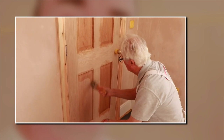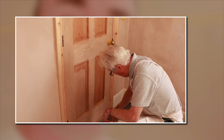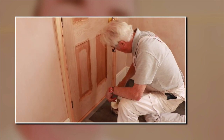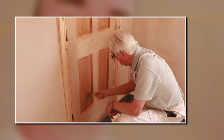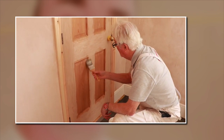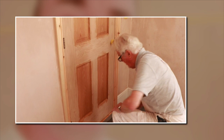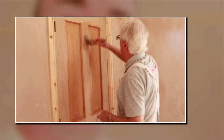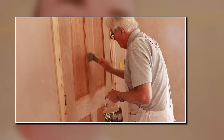This is just the first coat we're putting on. It dries quite quickly. If it was on the floor you can ease it slightly with clean water at 10%, but on these doors - because this varnish is so thin - we're not even bothering. We're just getting it on. This is a protection coat before I start spraying, before I do any other woodwork painting - get a protection coat on to protect it from anybody coming into the property and touching it. When we come back to do these, we'll give them a sand down with one of those finishing pads.